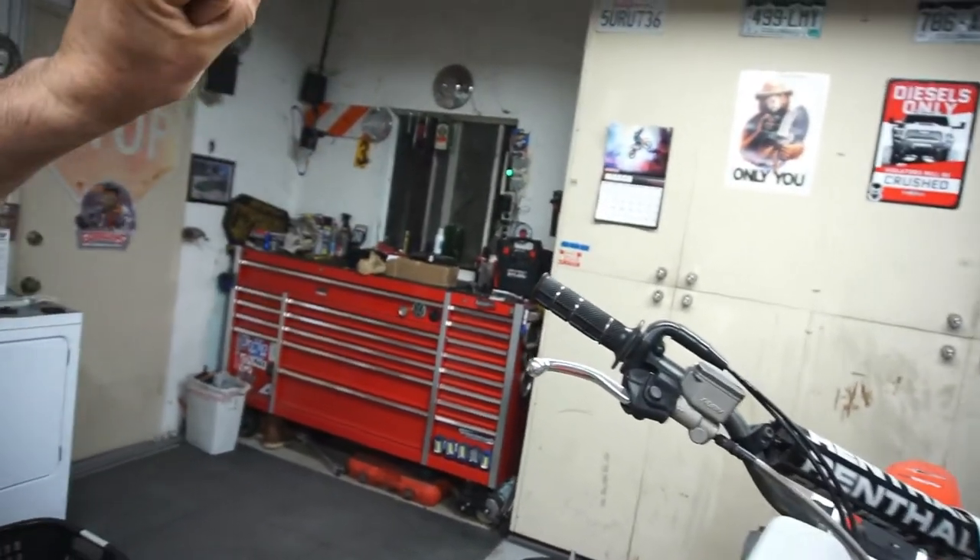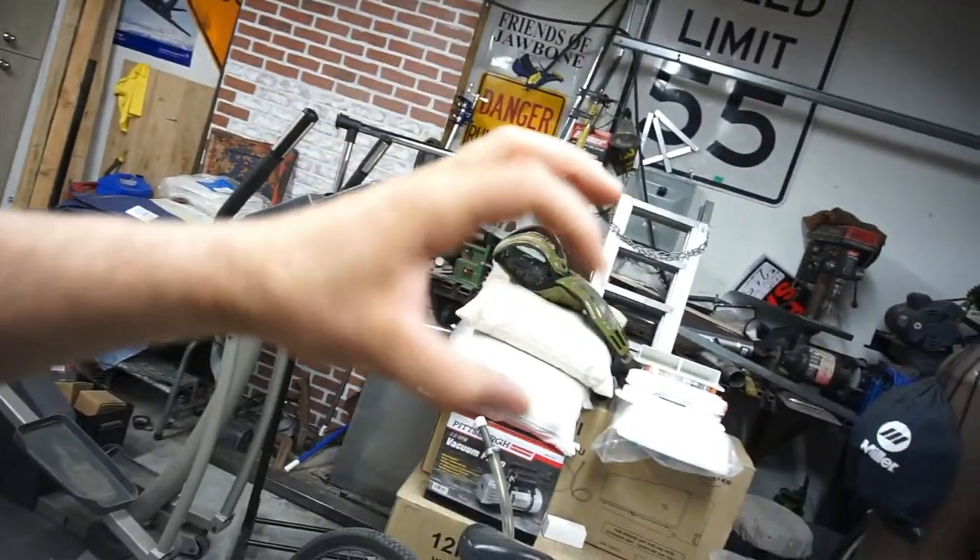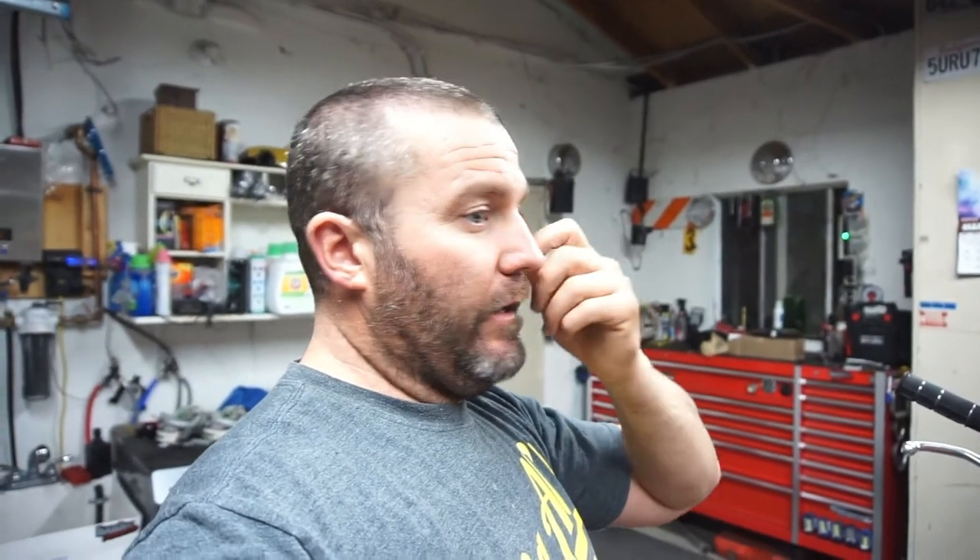I want to do the siding on the side of this house so I can run this and put this AC unit in — I don't want to put it in and then do siding, because you've got to drill a hole on the outside of the house and run ducting. I also have a friend who's going to do me a huge favor — he's going to do a whole new breaker box because mine's only 100 amp. He's going to do 200 amp with a lot more breaker switches. Mine's only about 10 to 12 and I told him I wanted a minimum of 20. That's it — guys, that's my weekend.